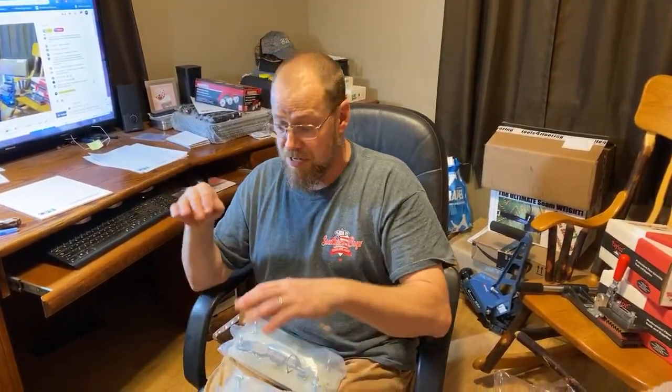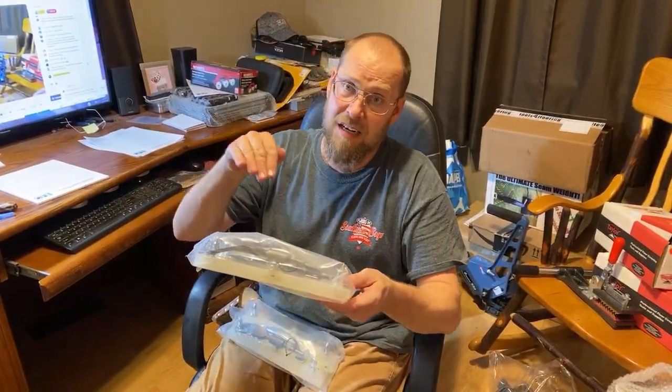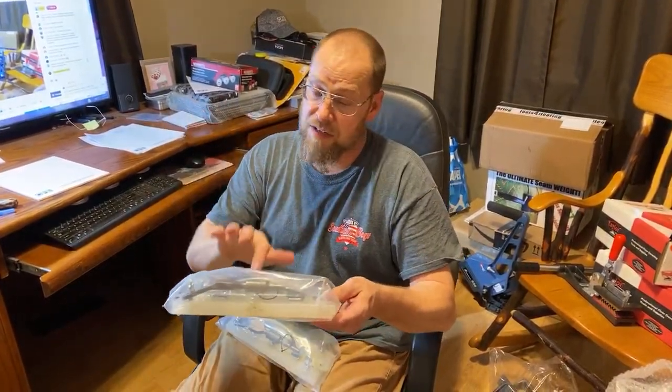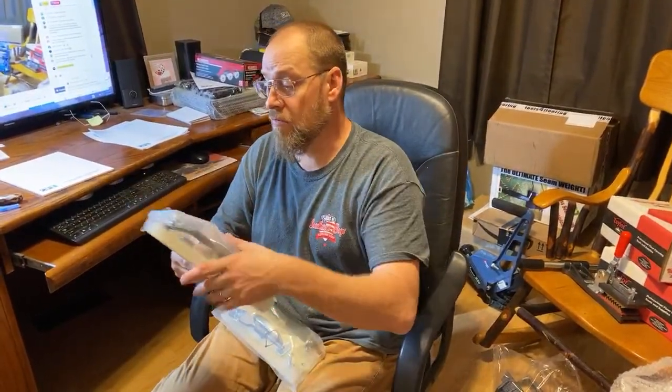A lot of times you damage the end of your boards, and when you get it almost there, you got to pull it back out because you boogered the end of it up or something like that. This right here will eliminate that. It just vibrates right in there. These are super awesome for doing repair work like that, lacing in or even glue down wood.